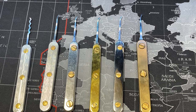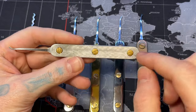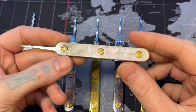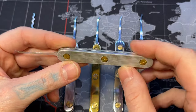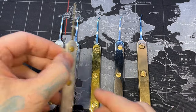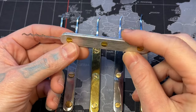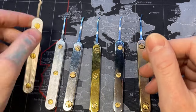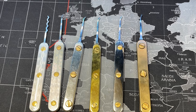With aluminum itself, you can go up to a full quarter inch and not lose the feedback — they feel absolutely great, because aluminum isn't as dense. If you have a machinist friend, have them do some aluminum for you and you'll get perfect holes. Even just machined aluminum looks cool without any polishing, and you can get the exact thicknesses you want. With aluminum, 3/16 feels a little better, but quarter inch also works great.